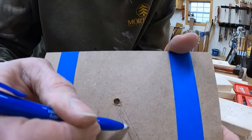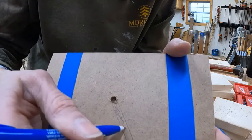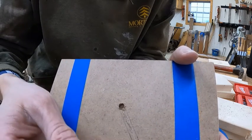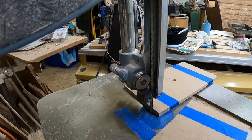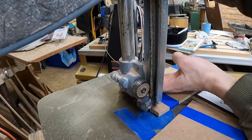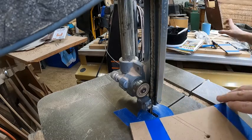So if you can see, this material in here is the material that becomes waste. I'll go to my bandsaw, cut here and cut here on both pieces. At the bandsaw I'm going to lower my upper blade assembly so it's about a quarter inch above your board, then turn it on.